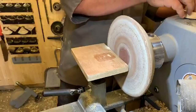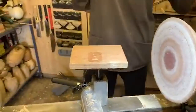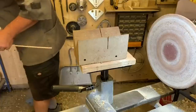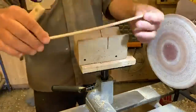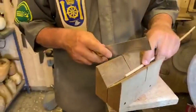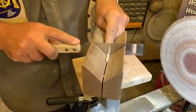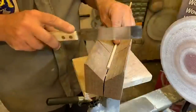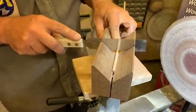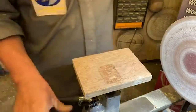We want to go through the feet and into the base, and then be able to take the legs. Don't try cutting dowel on the bandsaw — you'll have bits of dowel flying everywhere and it can be quite dangerous. Just a little block like this and you can sit and do loads. Once you've done that, grab those and start fitting things together. There we are — we have our two feet waiting on legs. Onwards to the legs.